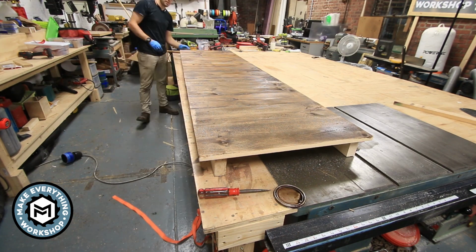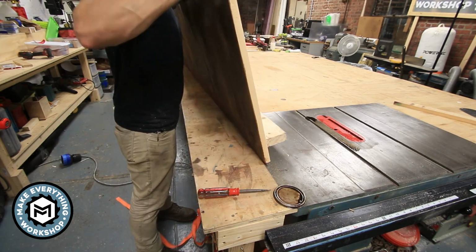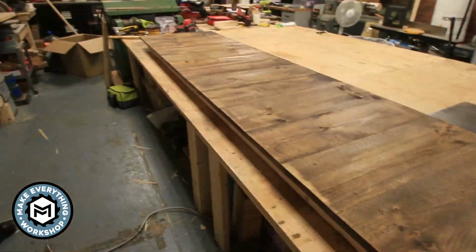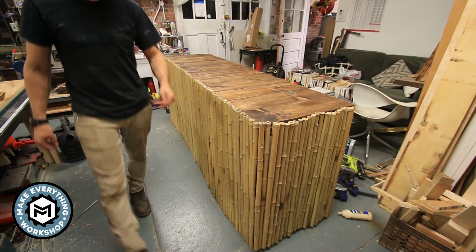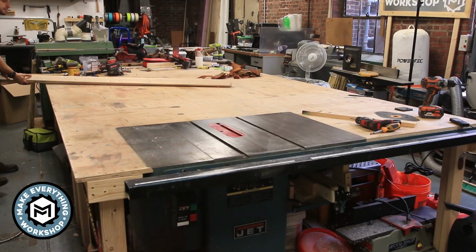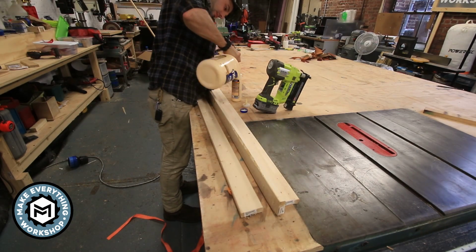And this is going to get beat up pretty quickly, so I'm not super worried about the high level of finish, but I just make sure I stain every area so that you don't see any light wood. There's one spot that didn't really take the stain, but other than that, it came out really nice. The classic walnut stain on this pine gives a nice medium brown look, and a lot of times when you stain pine brown, it gets washed out and looks just dark, but this comes out nice.